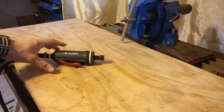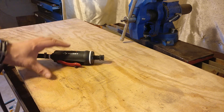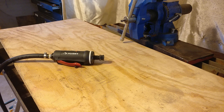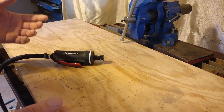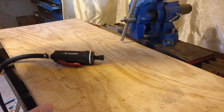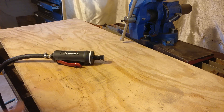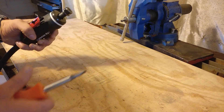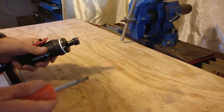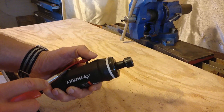After a few times of using this, I got frustrated enough and looked into it, and found out that there is in fact a speed control built into most die grinders. I found a video from Chucky2009 — he's a popular welder on YouTube, I can include that in the description below — and he showed that in all of his grinders, there was a screw you could turn to adjust the amount that this valve here actuates.